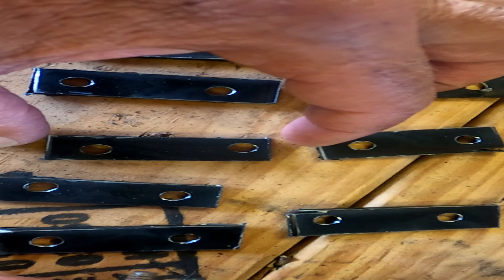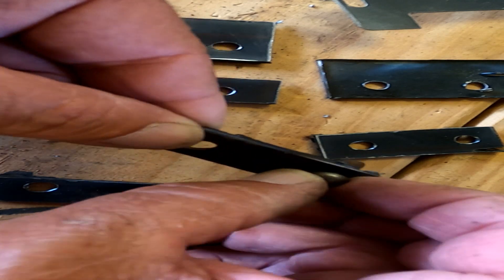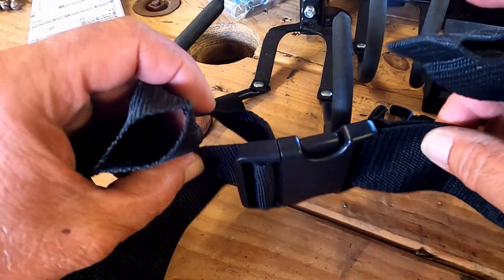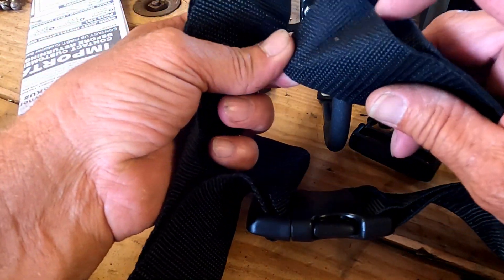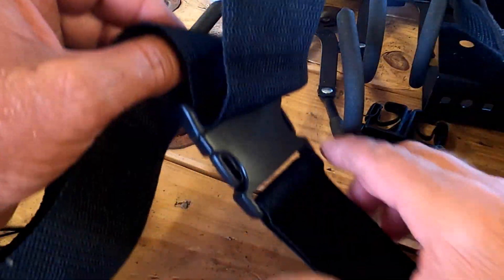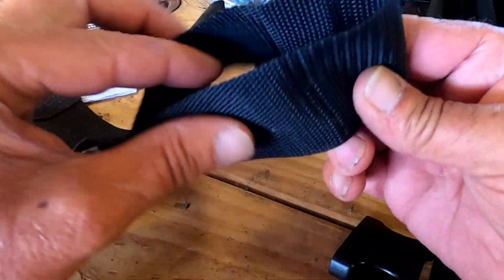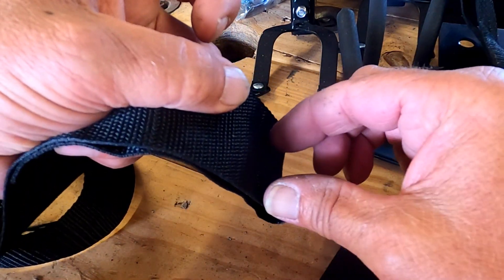I made some pieces of metal that I'm going to use as a backer. I'm going to bolt it through the plastic of the sled — these just give a little more support than just the straps. The straps that come in this kit go around the kayak and tighten up. Instead, I'm going to disconnect all of that, have two separate straps, double up the material, make it the length I want, and drill two holes to mount it to the side of the sled.